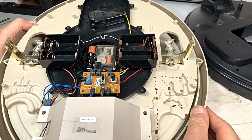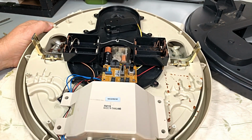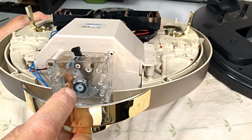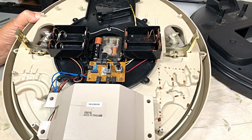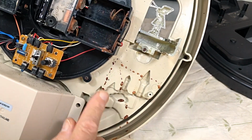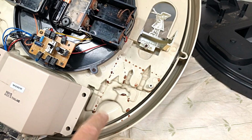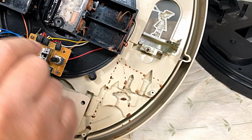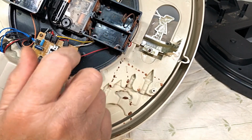So there we go, guys. Pretty straightforward type of mechanism. Little motor, a little motor job down the bottom here with our little rain indicators, and yeah, all looks pretty straightforward. But as you can see, there's been a bit of corrosion happening, and I'm not touching this because, believe it or not, this is still wet, and it's still wet in here, so we've got to get rid of these things. Easy enough, 2 screws either side, and we'll just fit new holders.